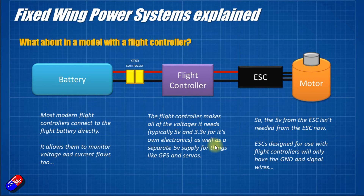However, it gets a little bit more complicated when we add a flight controller inside the model. Lots of flight controllers these days — either on the board itself if it's an all-in-one, or as part of a stack with a power distribution board underneath — change how power is routed. The battery now connects to the flight controller first, and the flight controller then connects to the ESC. So the flight controller is sitting in between the power connector and the ESC, and it has additional electronics on board to manage the voltages.